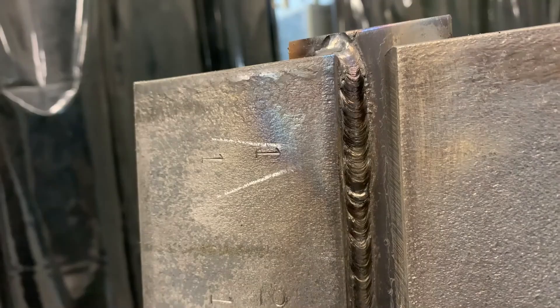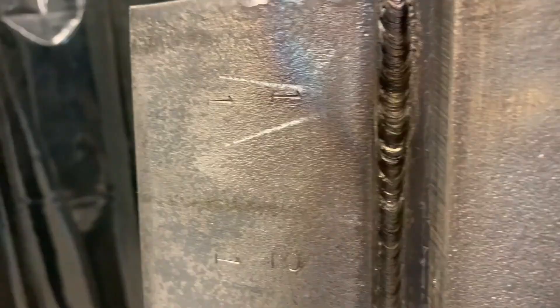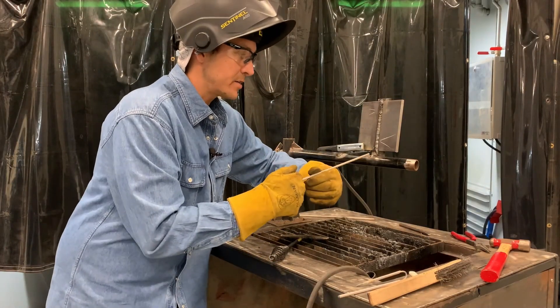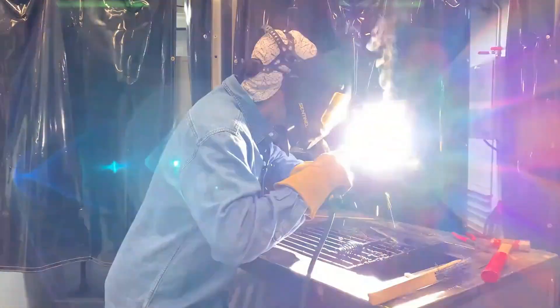So that was quick — the idea is that we don't have any great undercut and our bead is the right size. Now it's time to do that second pass. My technique is to go quick across the middle and pause on the sides a little bit, always moving — we don't want to crown up in the middle. With the square side cleaned up, we're working on the bevel side. I chose to do this in two passes, so I'm weaving up against that bevel side and washing up into that fillet weld. We go quick across the middle and pause on the sides so it doesn't build up. I'm only coming up about half the diameter of the rod at a time, watching those toes, and once I approach that stop I break the arc quickly.